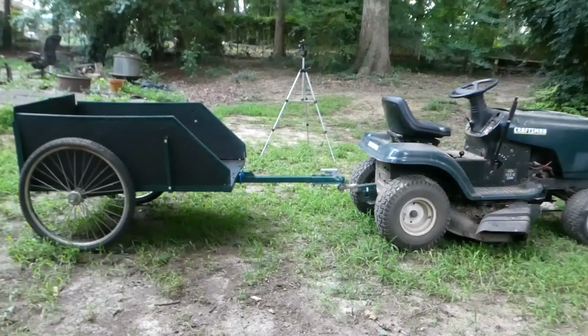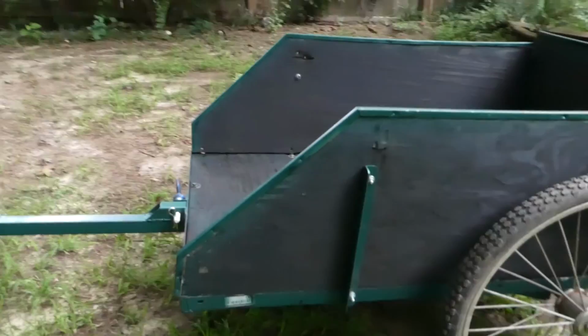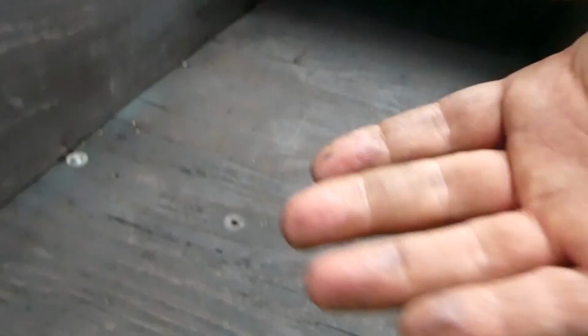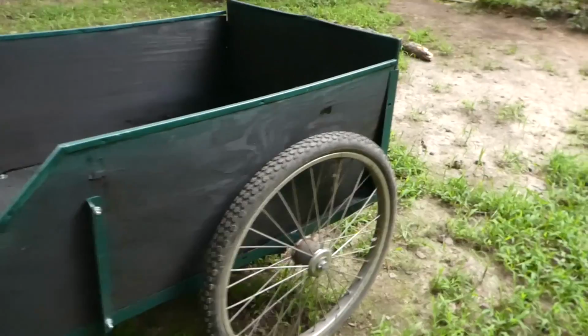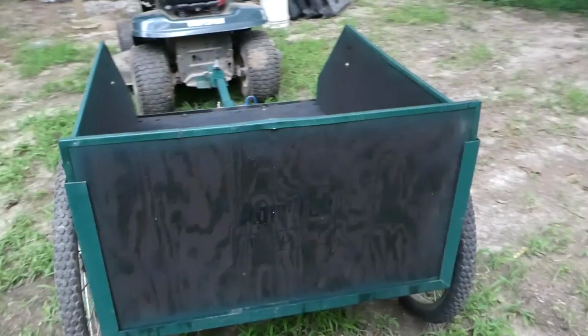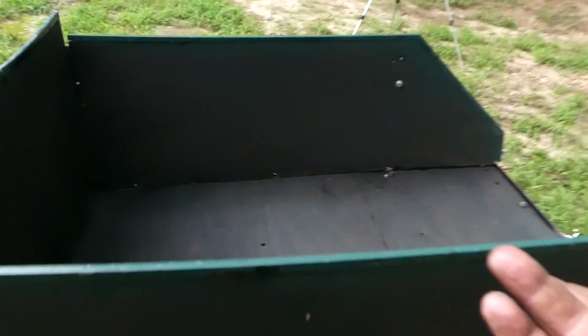The oil that's on the deck, I wouldn't say it's dry. It'll still come off if you rub on it quite a bit, but my fingers are already dirty, but I think you get the idea. It doesn't really rub off that much once it soaks into the wood. On the sides, I actually modified my formula a little bit to get it to soak in more. That's maybe 8 parts oil to 2 parts paint thinner instead of 10 to 1. I think that soaked in a little bit better. They seem to cover a little better and dry a little faster. It's just kind of an experiment.